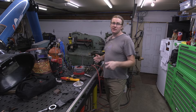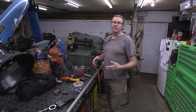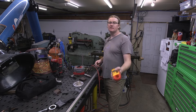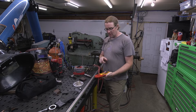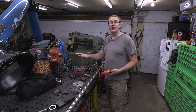If you jiggle the cup or if you're just kind of having a shaky day, it gives you a little bit more room to play around with. So you're gonna need to get a clamp meter or something to this effect — this is just a Fluke clamp meter. You can clamp it on your ground clamp, your TIG torch, your power cable, whatever. It will show you how many amps you're pulling.